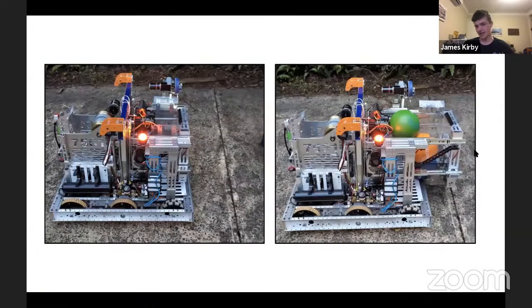Here is the intake from our 2019 robot in the prototyping stage, so please forgive the messy wiring. One can see here, one problem with the draw slides, as I said, is they pop out. On the right-hand side picture, you can see we have on both sides 2 draw slides. One of them is vertical and the other one is horizontal. This is so that the strength of each would cancel out.